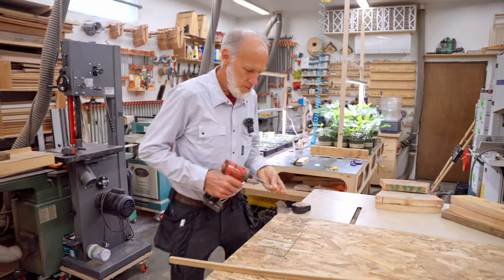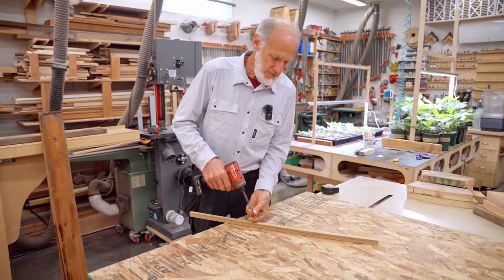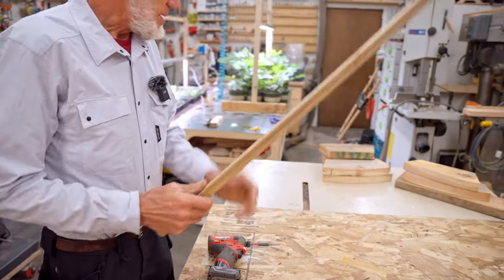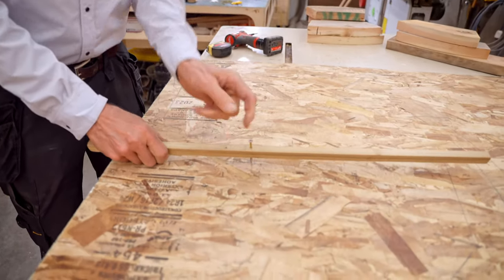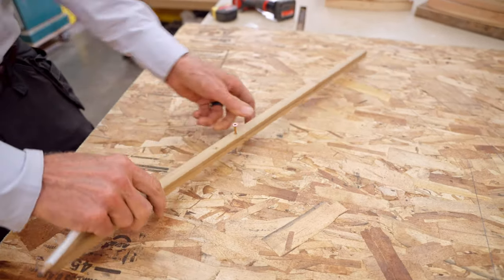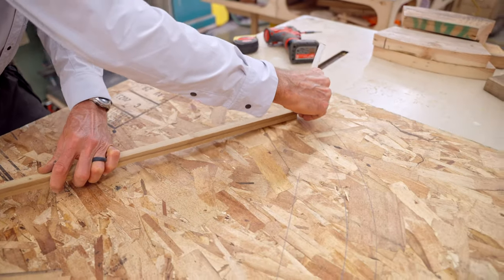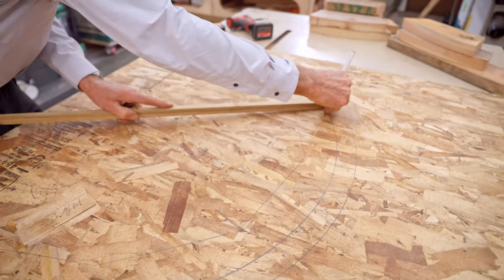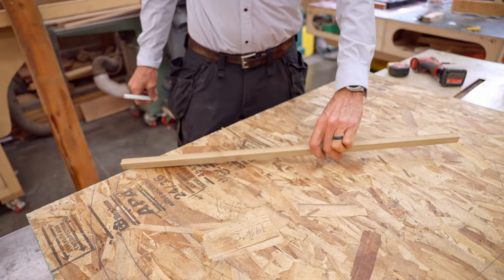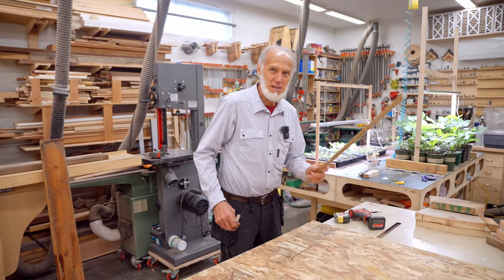I just use an old stick, just find an old piece of scrap laying around. What I've done here is I just screw in just a sheet rock screw in here and put it in like that. Then just find a place kind of in the middle of your board where you want to build this. So I just put that there and then take your pencil, holding it at the end, put it right against the end of the stick, and keep your hand on the pivot point so it doesn't move. And you just strike an arc like that. Very simple — just an old stick and a screw.